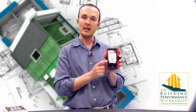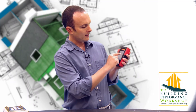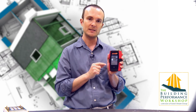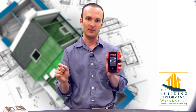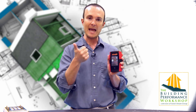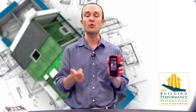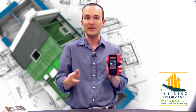That's all really handy. All I have to do to get back to the main screen is just hit the back arrow. Moving clockwise, we've got channel A, which will always display pressure just like it always has. One interesting thing about this equipment is that it now has digital pressure sensors, not analog. The main difference is twofold: it's more accurate, and it only needs to be calibrated once every five years — compared to the current manometers that need to be sent back every year or two or field calibrated.